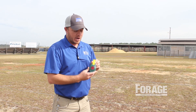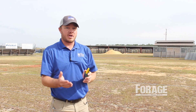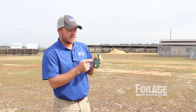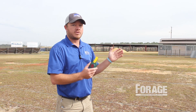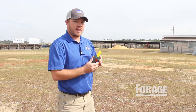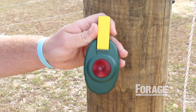A tool that helps you know when you've got a short on your fence is a device called a fence alert — there are a few others on the market that will notify you when you've got a problem. With this one, there are settings on the back; slide the button to the top, to number two, which sets the internal sensor at 2500 volts. Hang this fence alert on your fence line, and when voltage drops to 2500 or lower, it starts flashing and blinking. It's pretty bright right at dusk — you can really see it blinking.